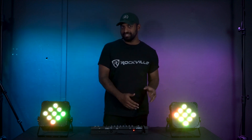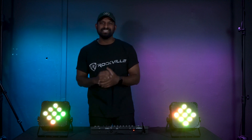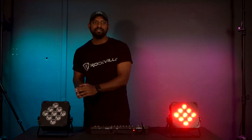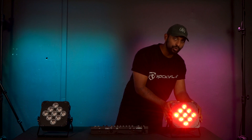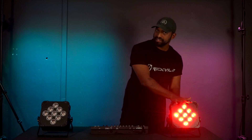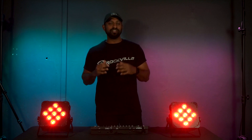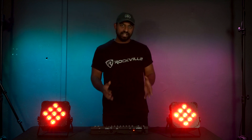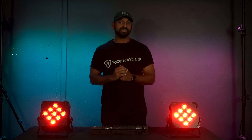That would mean my first light is still set to A001 and my second light is set to A007, since the FEST PAR 60s are used in six channel DMX mode. Since the second light is set to A007 and the first is at A001 — six DMX channels apart — fader one only controls red on the first light, and fader seven starts the red on the second light. Using different DMX addresses gives you independent control. It's important to keep track of all the different DMX addresses, but if you ever want a clean reset, just set all lights to A001.